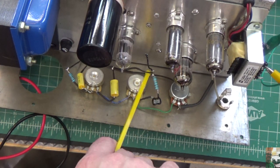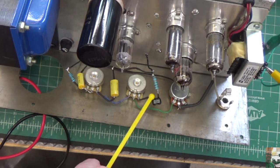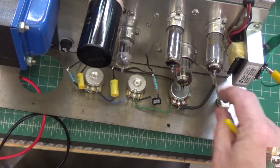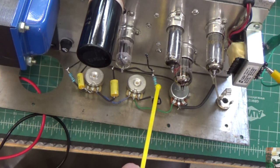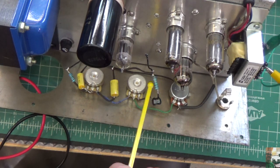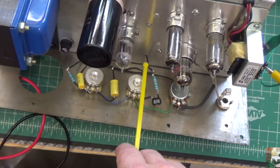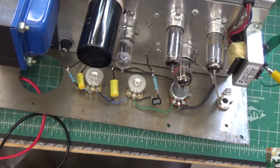I should have mounted these components underneath the chassis where they belong, but I mounted everything here on the faceplate. My next step is going to be to take all these components, remove them, and mount them underneath the chassis. That should put me in a better place, ensuring I don't get as much noise. I believe what I have here is some kind of feedback loop happening with these tubes and these components. If I remove this faceplate and move the door out of the way, I'd probably be in much better shape. So we're going to remove all these components, mount them underneath the chassis. Just have single shielded wire running up to these controls. That's the plan.